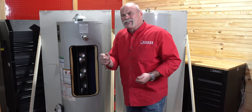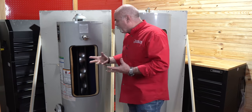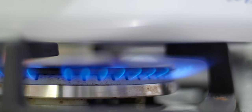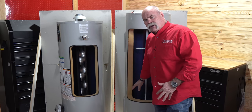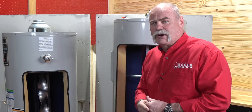It's not really boiling because it won't get that hot. Your water heater should be set anywhere from 110 to 125 degrees, maybe 140. But especially in a gas water heater, as you've got that flame down there heating it up, the water is heating, expanding, and rising through all that sediment — and that's what makes the noise. It's not quite the same on an electric water heater, but you can still get that noise.